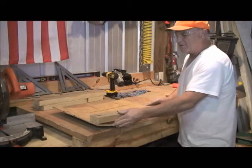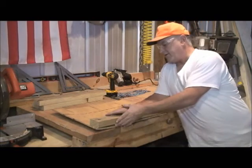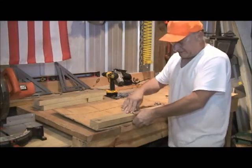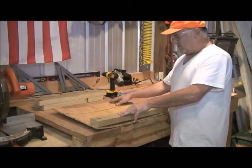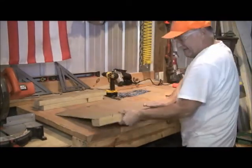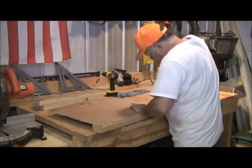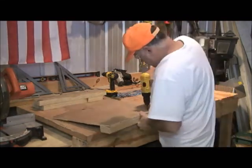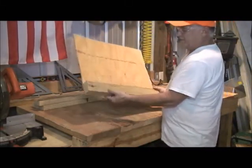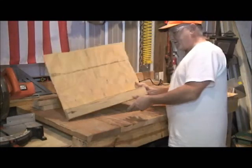For this door, we're putting the trim on the outside. This is the big one that's going to be in the back there, in the enclosure part, and it's going to be like a ramp. And when it comes down, it'll land on this pressure-treated wood that we're going to have all around framing it. Just turn it over, make sure it's lined up, and screw it down. And this bottom piece, we're going to put little hinges on it. It's going to just come right down and give it a little ramp.